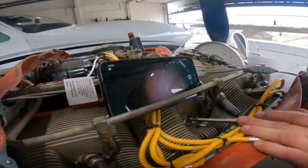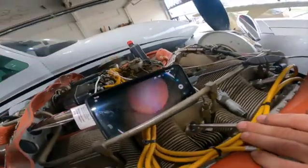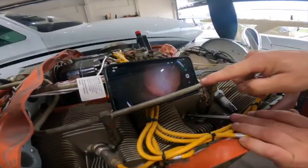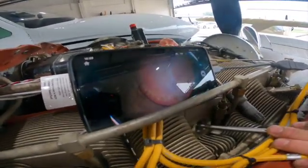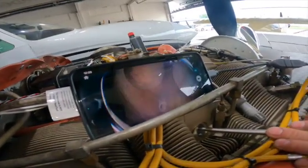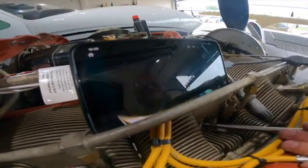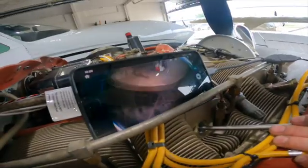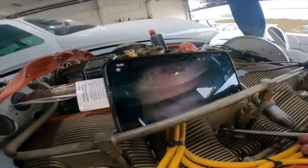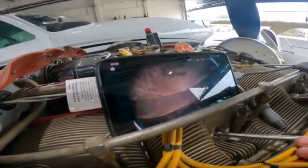This is the one where it's not perfect as far as the coloration goes. There's a little bit of a hot spot on the side. A little bit of a ridge at the top where the ring stops. You can see right where the piston ring stops — there's just a little bit of a ridge developing.